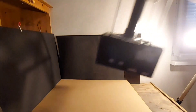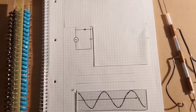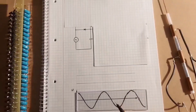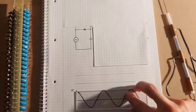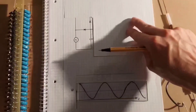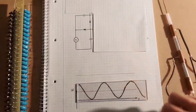That can be built in small size, medium size, or big size. But there are a few things you have to keep in mind when building one. A multiplier is basically a stack of rectifiers and capacitors. In the rectifier, the cap is charged through the diode in one half cycle, and the other half cycle adds to the voltage in the capacitor. So you have an AC part and a DC part, and this lifts your AC up.